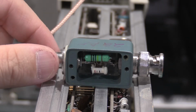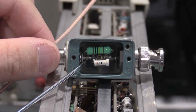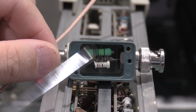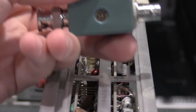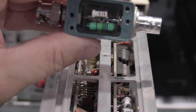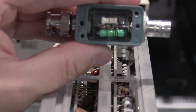But the input normalizer, all the input normalizer is, is an adjustable capacitor on the bottom, a resistor, and a capacitor, and that's it. You get to the adjustable cap by pulling this cap off. Right there, there's the capacitor adjustment. Everything's in parallel. The values are very specifically chosen for the individual RC normalizer.